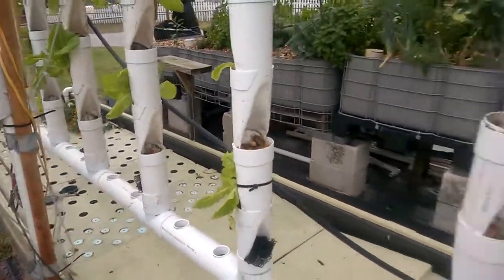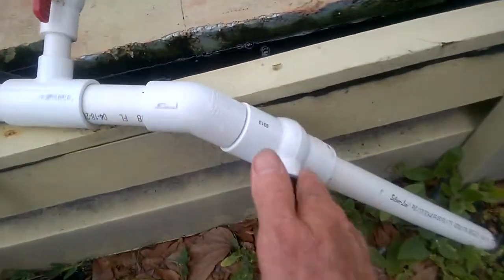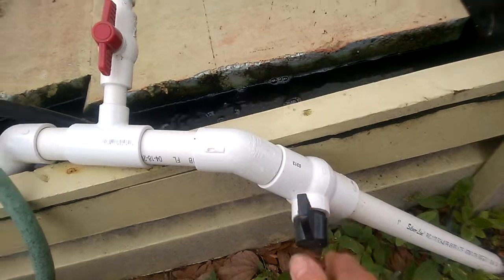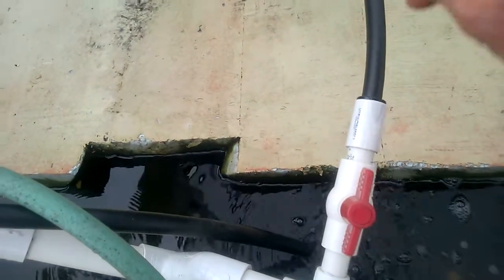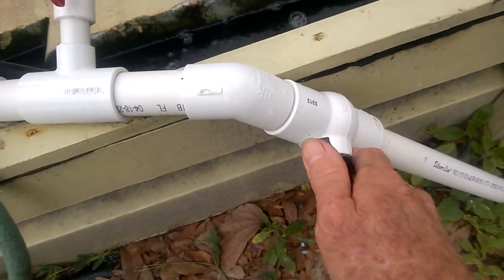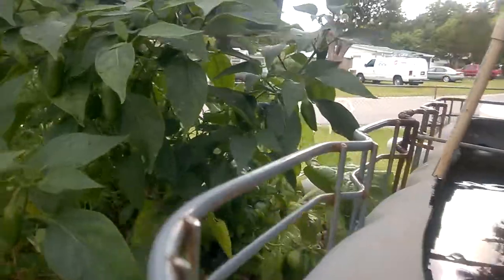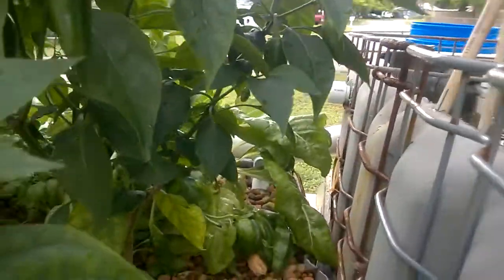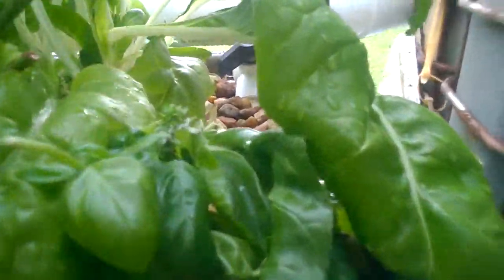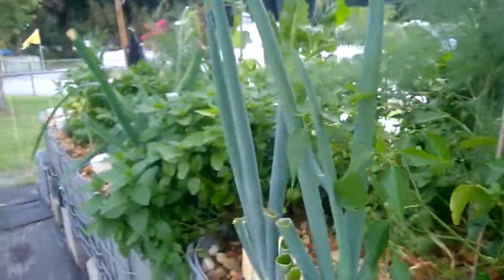It's all a matter of keeping the balance between how much water I've got going in — I control that here. All the extra water goes up into the towers, and by controlling this valve, that controls the level in the tank. The balance is controlled with that 1-inch valve coming out of the 3-inch drain pipe. So it's all just a matter of checks and balances.